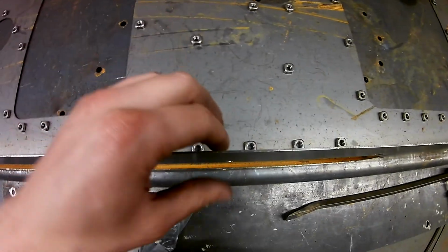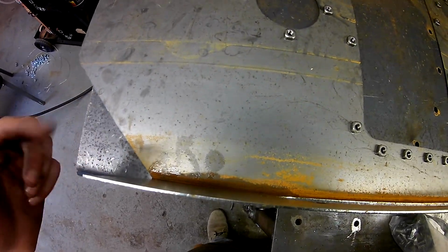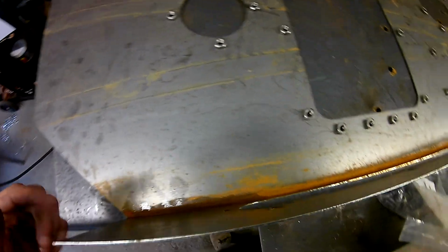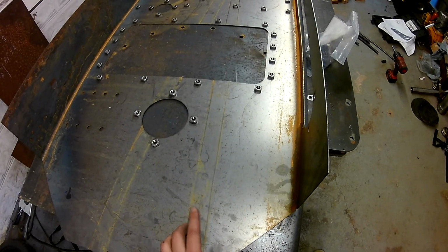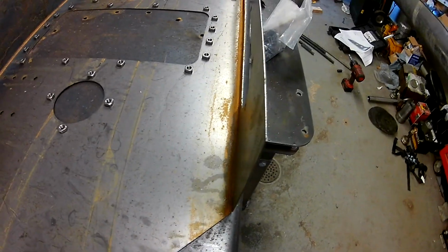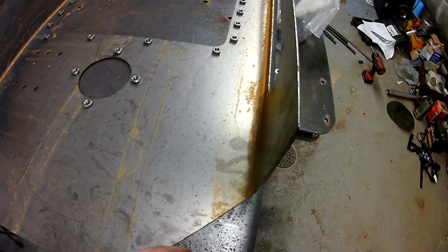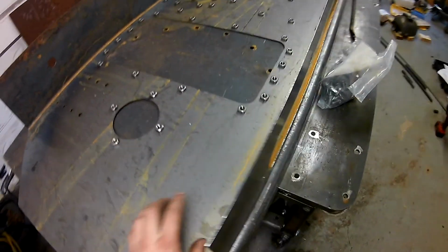One thing I will say, even though it was recommended by the Russians, 16 gauge to me is a little thin. I know the whole point is keeping an ATV as light as possible, but I think in the future, if I were to build another one, this will definitely be like a 14 or a 12 gauge. Plus, in those higher thicknesses, you can get a 80 KSI material. This is only a 50 KSI quench and tempered.